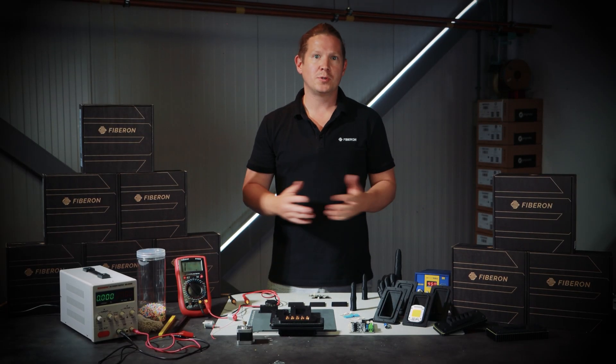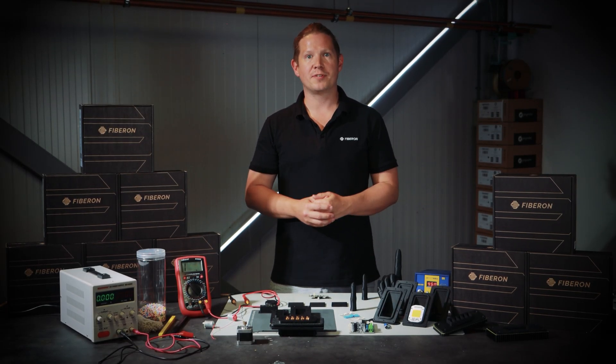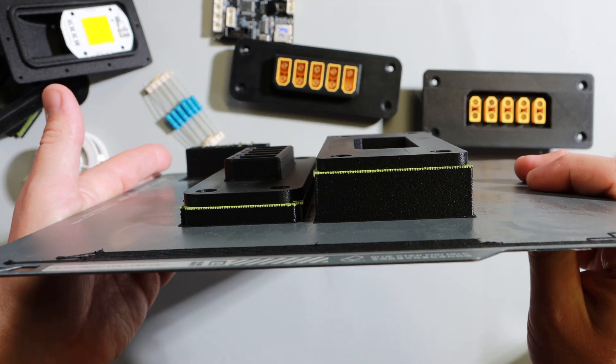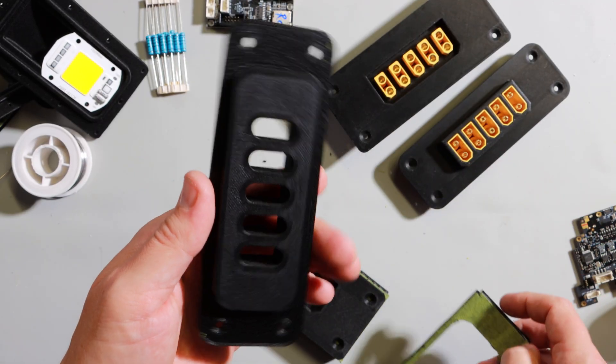612 ESD also works beautifully with poly support for PA12, which is our breakaway support material for long chain nylons. In this print I've used just a couple of interface layers, which allows the support to be removed easily by hand, leaving a very tidy surface.